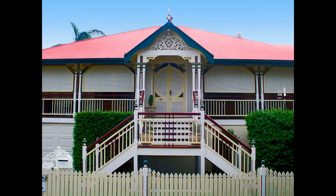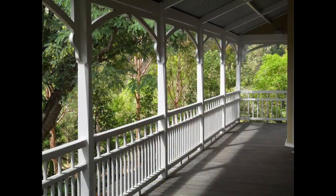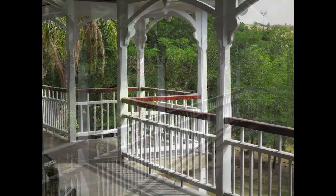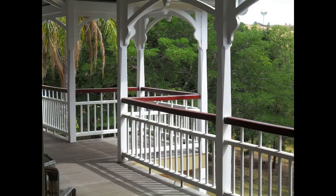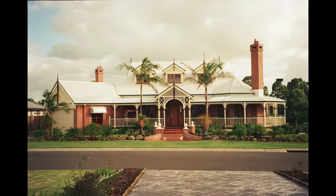It is in the very nature of hardwood for its surfaces to slightly split or crack. We recommend that balustrading be sealed with oil-based paint or sealer within 48 hours of delivery. If slight surface cracking occurs, a light sanding might be necessary, followed by filling and a second coat of primer sealer.